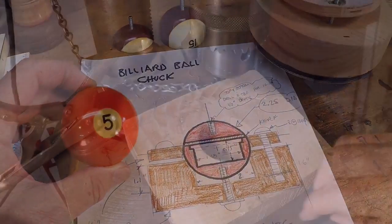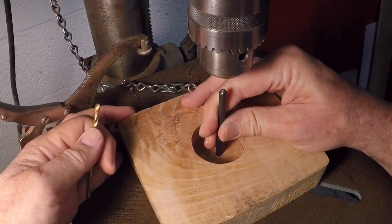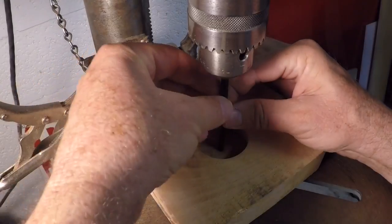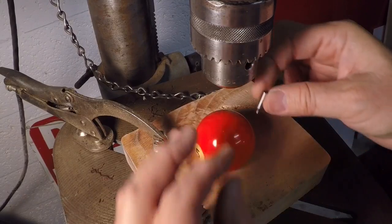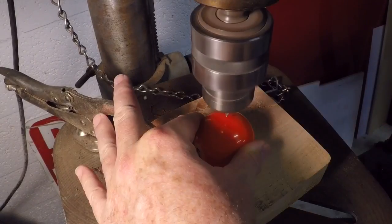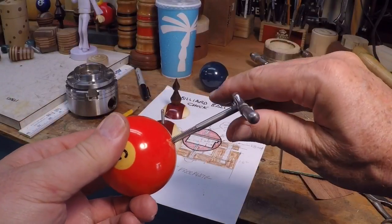To attach the ball to the chuck I need a hole at the top or bottom of the ball that goes through the center. I made this little jig aligned to the center of the spindle of the drill press — it's just a Forstner bit hole with a quarter-inch hole at the bottom. I use this transfer punch to align the jig to the center of the spindle. I'll eyeball how I put the ball in the jig to identify where the top is, and I'll use a little centering bit to establish a divot for the drill bit to bite into. This is a good time to note that the phenolic has a nasty dust that comes off it, so it's really important to have some sort of respirator — you do not want this stuff in your lungs.